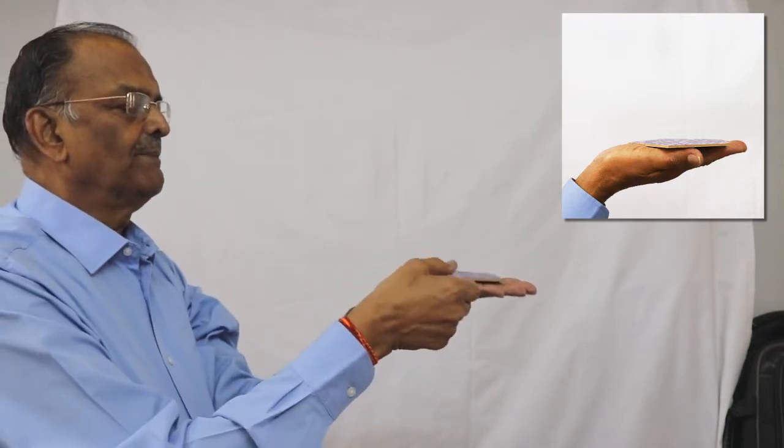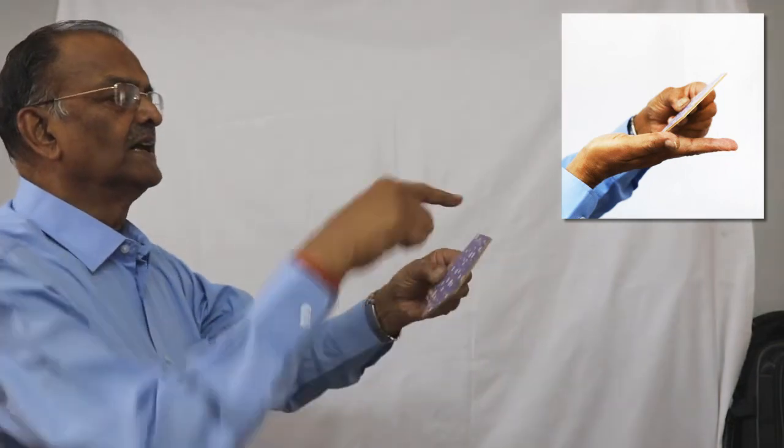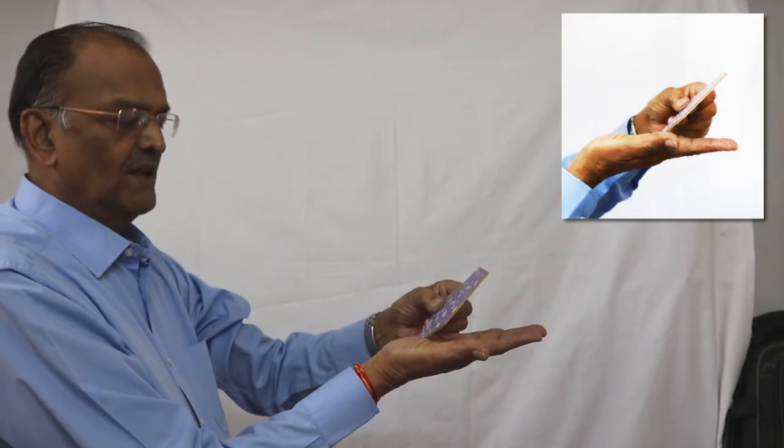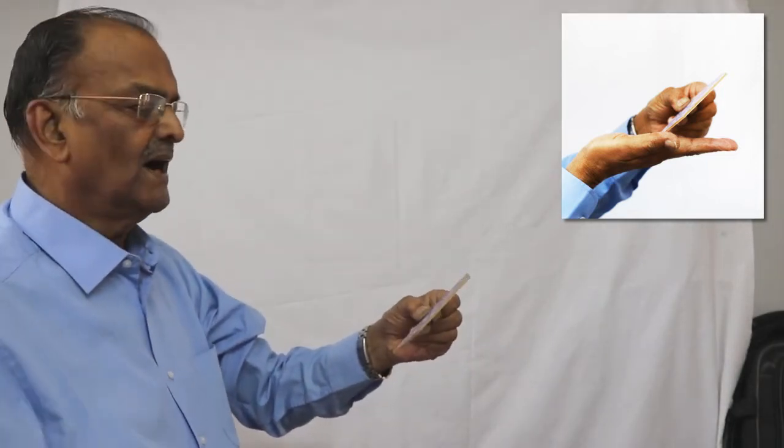The very first step, we don't know the angle, but to lift the entire lamina such that the opposite side is 20 mm above HP. It is 20 mm above HP as per the statement. Now we can find the angle.